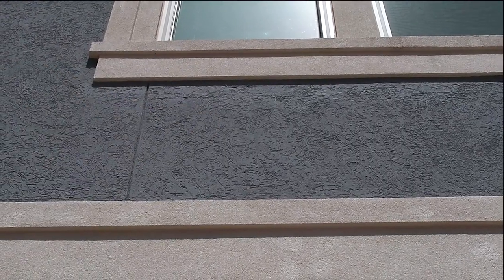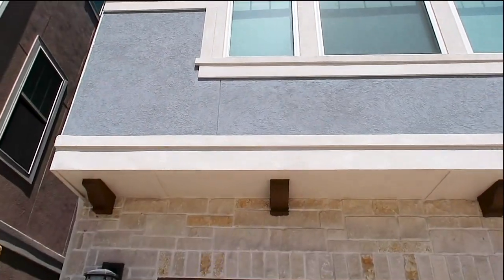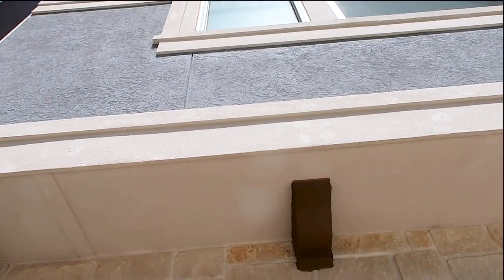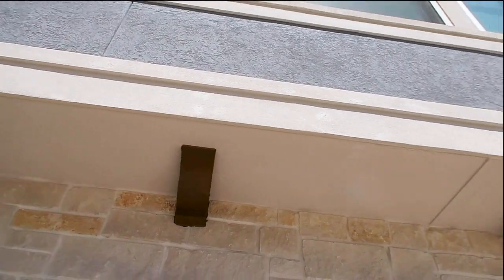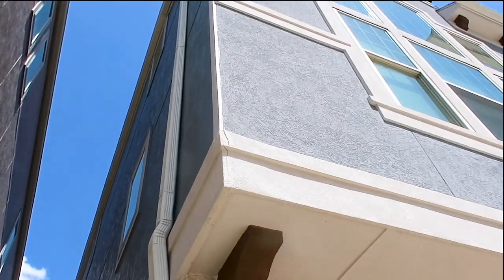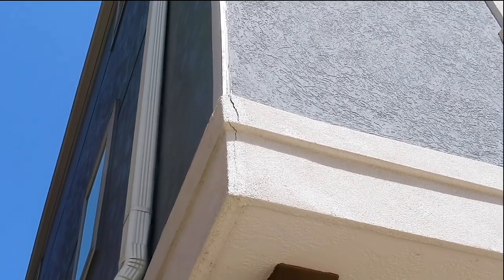There's a little bit of efflorescence, so you want to keep an eye for discoloration. There's a chance that window might be leaking. They didn't order an intrusive test today, but we'll recommend one because we see efflorescence in that area. Also right underneath the stucco there should be a drainage path — we're noting a missing weep screed at the base of the stucco in this location. This crack in the stucco is larger than typical, and we'll recommend it for repair.